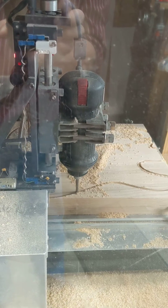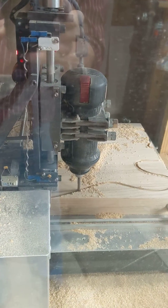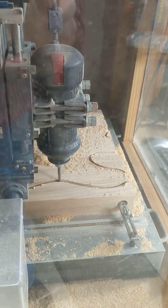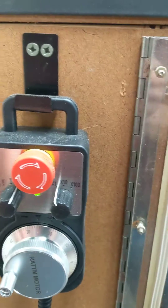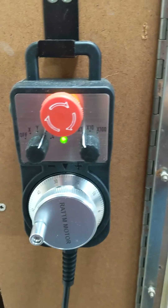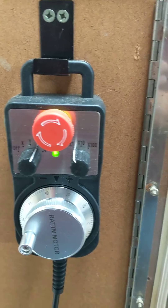I had a little bit of trouble with homing and needed some capacitors on the micro switches — maybe you can see there — to get rid of some of the noise on the homing switches. But other than that, pretty happy with the purchase.